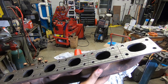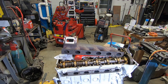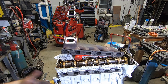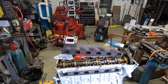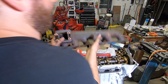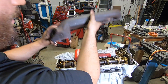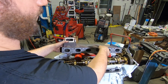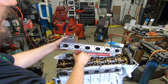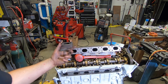Looks like we saved this one from the scrap pile. This thing is some old iron — it has seen it all. Now that the flanges are flat, the turbo is going to seal up great, it's going to seal up great to the cylinder head. We're going to weld the wastegate pipe directly on because those bolts aren't accessible when I'm in the car. This has been a cool one — first time doing this, worked out awesome. Definitely takes some time though, probably two hours into just clamping, fixturing, and getting it true so I could actually mill it evenly and make it right. Thanks for watching Spank Ranch Garage, talk to you next time.